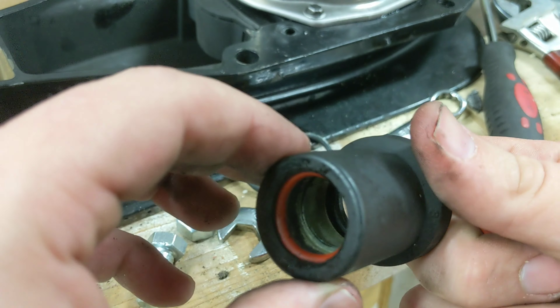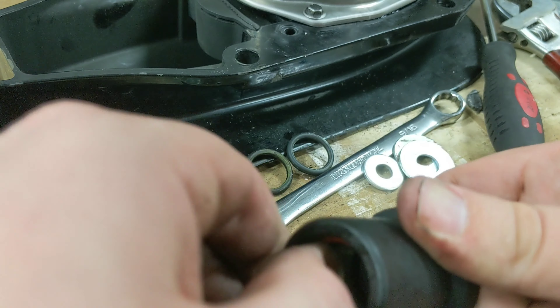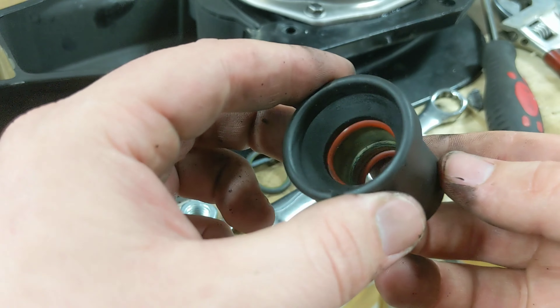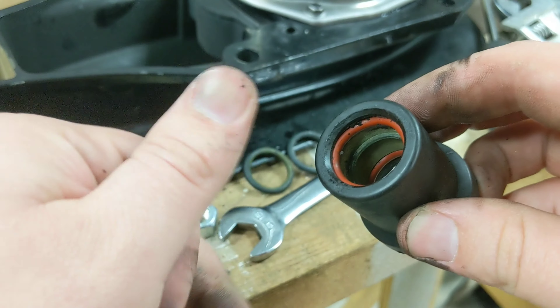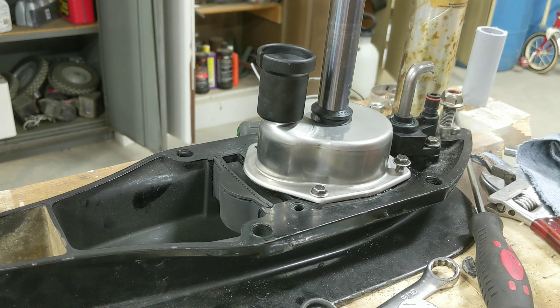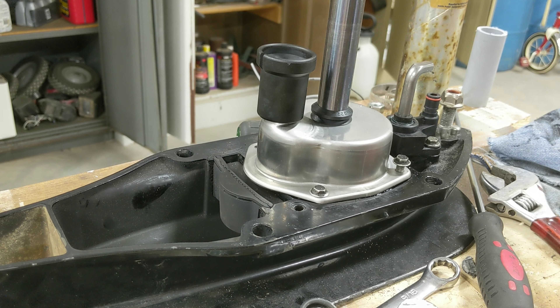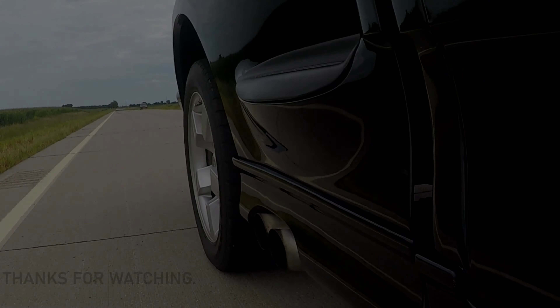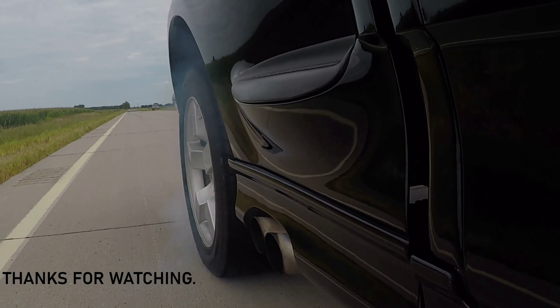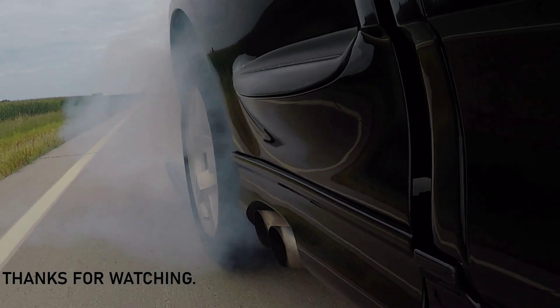The last part is the little neck piece that stabs onto the top. There are two O-rings down inside there — you've got to take both old O-rings out and replace them with the new ones from the kit. The old ones were kind of crunchy when I peeled them out. The new ones are more pronounced and pretty stubborn to get in, but there they go. Now I'll take a little blue grease and lube them up so the neck slides down onto the housing better.